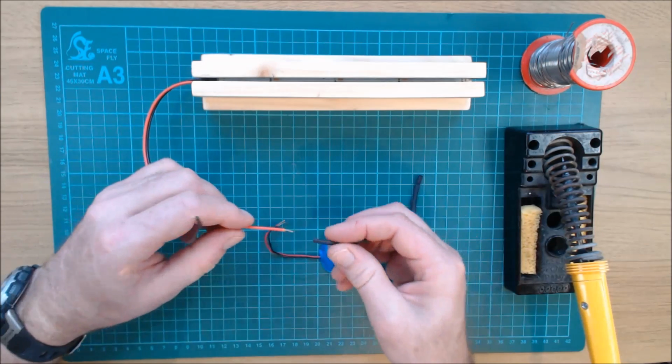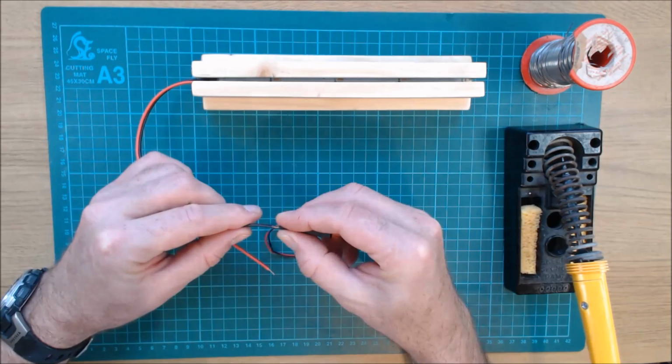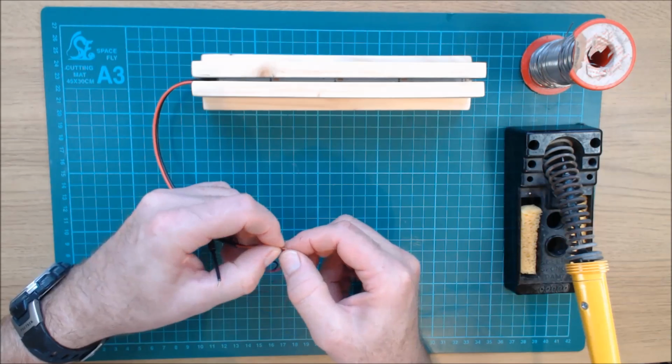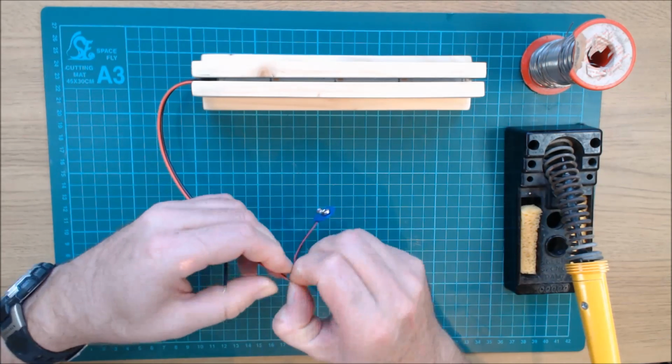Once the varnish was dried, I soldered on a 9-volt battery connector to the LED strip lead. The LED strips work from 9 volts to 12 volts and they are much brighter at 12 volts, so you may wish to use a 12 volt power supply instead.